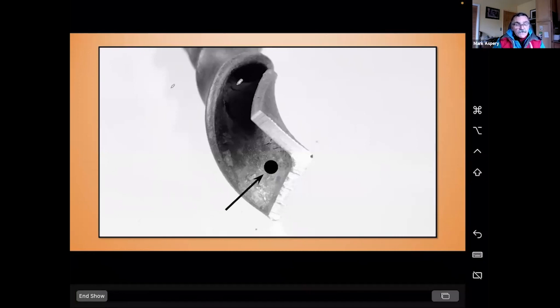Now, the twist does not have to be even. The twist can open up. This can be flat back here. I don't care. We just need a twist for the first 5/8 of an inch, 3/4 of an inch. No more than that. I mean, if you get twist along the bar, fine. But if you don't, that's fine also. Okay, so the second bit of the twist does not have to be even. I like to crowd the twist nearest the end, but not to the point that I cannot get my file in. Remembering that the edges deflect if you over twist, and we don't want the edges to deflect too much.